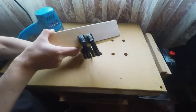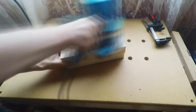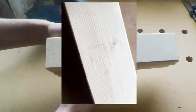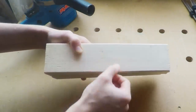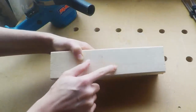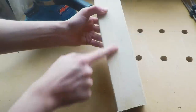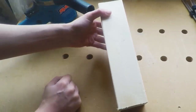Hopefully I've given it enough chance to dry now, so let's take the clamps off and sand it up. And that's the result after it's been sanded. There's a very faint line where the grain's been severed — if I'd taken it a bit further back without snapping it, perhaps it would have been a cleaner line. But overall you're going to have a perfect grain match, and it's simple — you haven't got to do any extra cutting for dowels or any other wood to inlay into it.